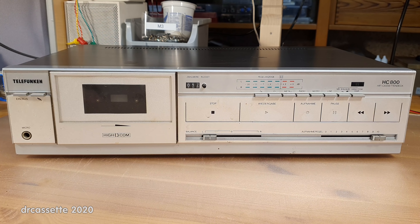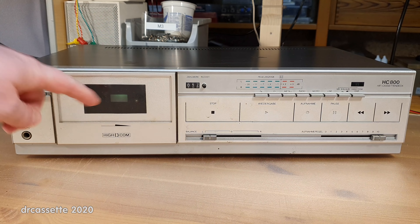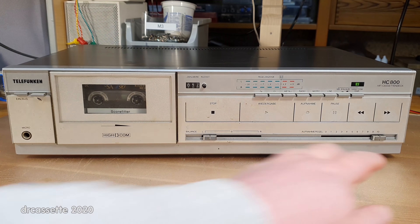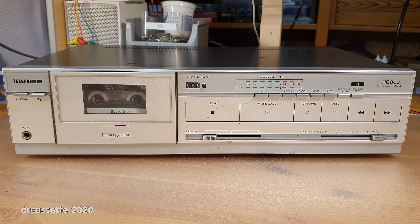Let's try to turn this on. That doesn't sound nice. We do have a light in the cassette compartment, and yes, there is also a light for the high-com noise reduction. Let's put in a cassette. We do have a rather weak fast-forward. I assume we won't have any rewind — nope, not enough power to do a rewind. Let's try playback — nope, that doesn't work. So no playback, and when the auto-stop triggers, there is oscillation. That's not good.